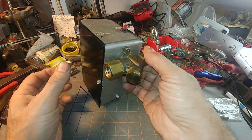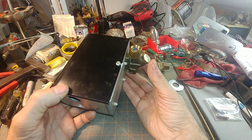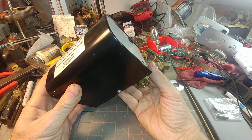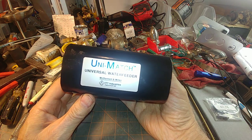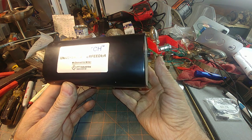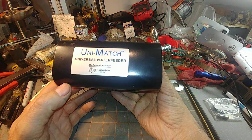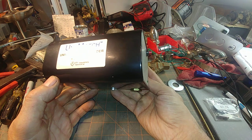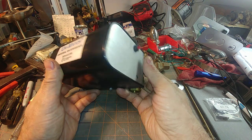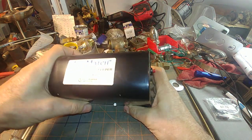Normally you're probably going to be running into this already hooked up and you're going to have to figure out why it's not working. I ran into one of these the other day that had been in service for a while and wasn't feeding properly. It wasn't hooked up properly, and also the internal valve had calcified.